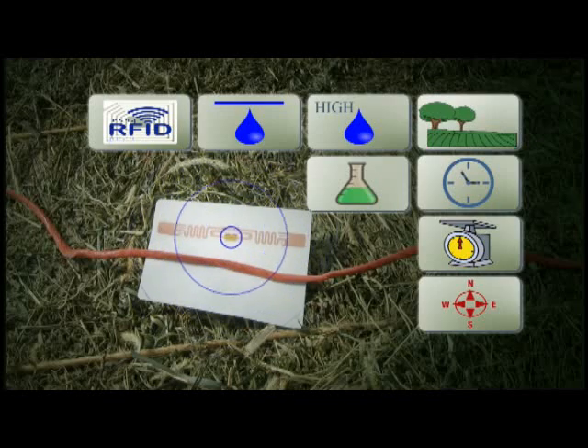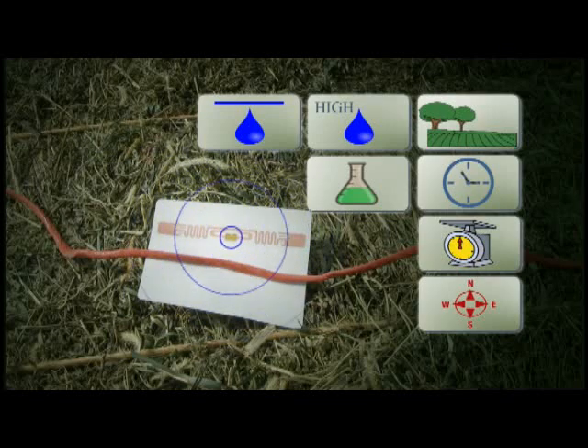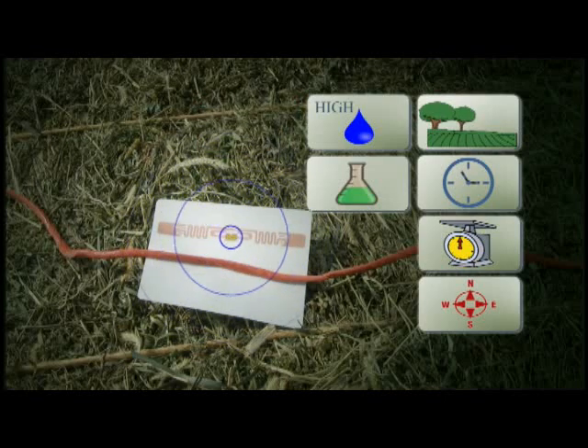The bale serial number: each bale has a unique number identifying that bale. Average moisture: if the bale is wet, or a little too dry, you're going to know — it's on the label. High moisture: those slugs will ruin a bale and they can ruin a whole stack. You'll see that on the tag.